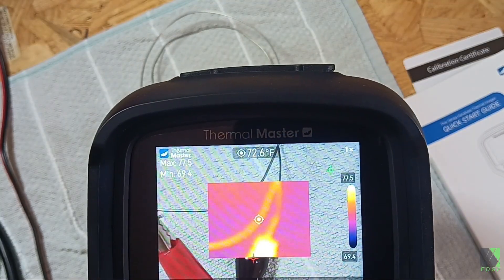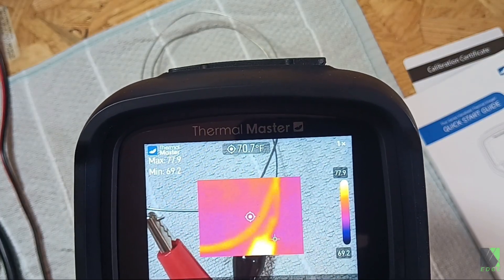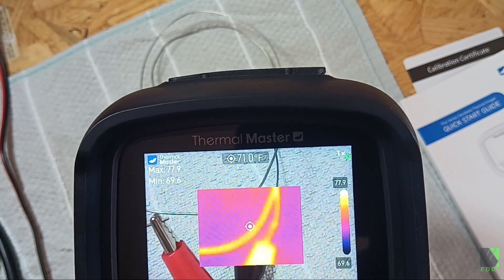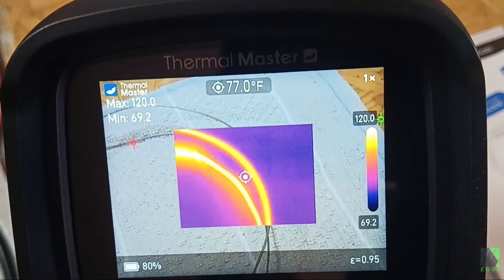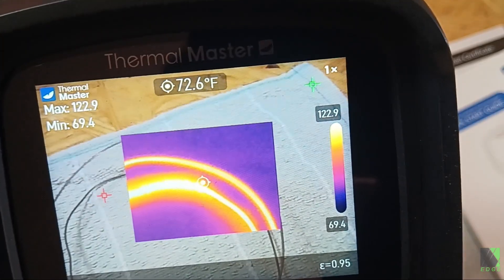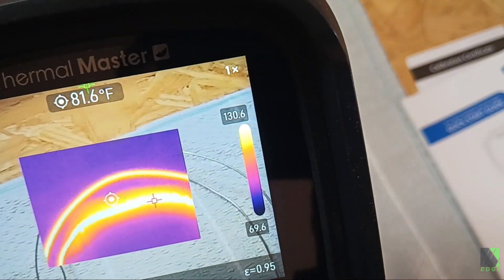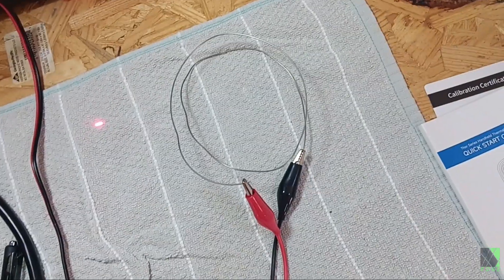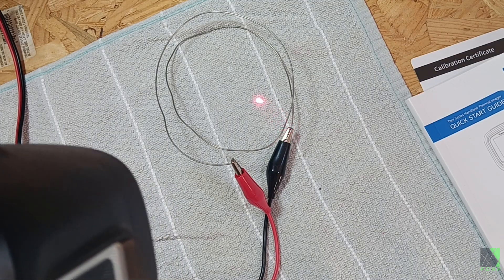The PIP or picture-in-picture mode is what won me over — it's much easier to use. It allows me to see exactly what I'm looking at as well as get some idea of what the IR picture looks like. There's still some parallax but it's a lot less annoying, and you don't really have to worry about it. Besides the pure IR mode, this is my favorite way to use the camera. There is also a laser pointer built into the body, useful for zeroing in on the hot or cold spot you're trying to examine.